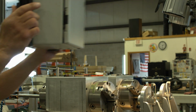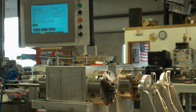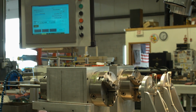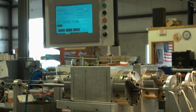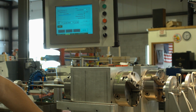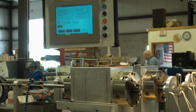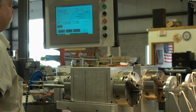We're going to go over the rifling machine here a little bit and how some of this stuff works. Start off with the basics. We'll call this our feeder box, chock box, spindle box, and then circuit box. And all the computers are talking together from another programmer down there. The bottom line is, right now we're doing a 30 cal. We're doing a 5R style rifling in 11 1/4 twist.